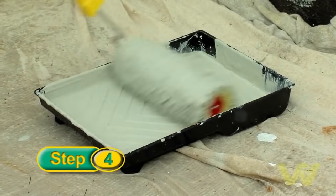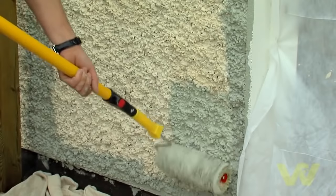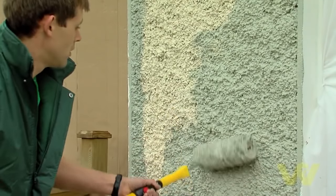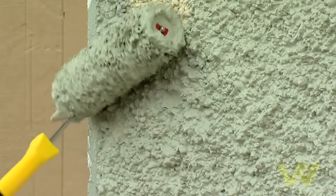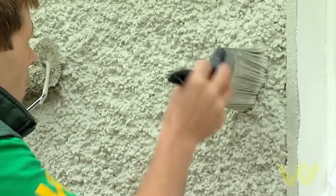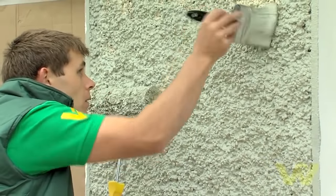Use a roller to paint the rest of the wall. Your roller should have a long pile to get into the little pebble dashed areas. Start at the bottom and work upwards, making sure to fully cover the area you're working on. Touch up any spots that the roller can't get at with a masonry brush. Continue in this way until the wall is fully painted.